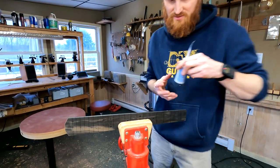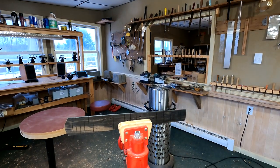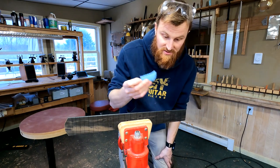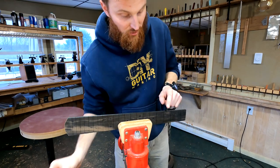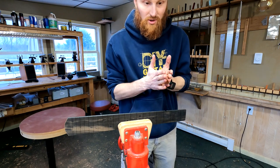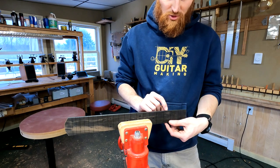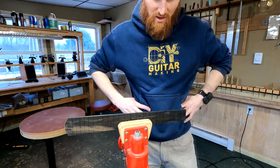It's always handy to keep a little piece of hard scrap wood nearby — like ebony — so I can put a little corner of the wood on there and give it a little tap if the pearl is sticking up at an angle. If it goes in nice and easy, you don't need to do that. That one's in, and I just add the tiniest dot of water-thin super glue. This stuff is so thin that if there's a little blob, I can just touch it with a rag and it wicks up. The super glue also wicks down into the joint by capillary action — it finds those tiny spaces between the dot and the wood. It's really a miraculous thing that you can assemble a super tight joint and then wick the glue in after the fact.